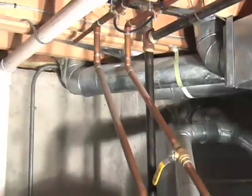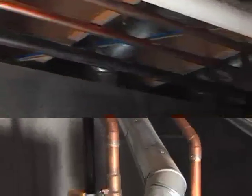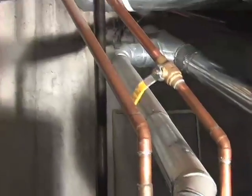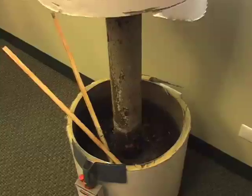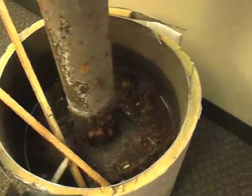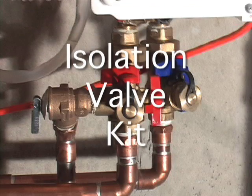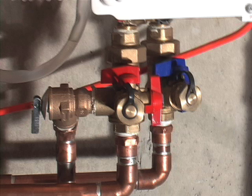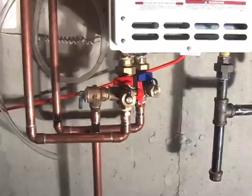The next step in the process is connecting your water. During the site survey, please make note of the water quality within the home. If the home utilizes hard water, a water softener is recommended. Without it, you can develop scale within the copper heat exchanger. This will diminish the life of the heat exchanger, just like scale does to a tank-type water heater. Although it is very easy to flush and clean the scale from a system with a set of isolation valves, it is still recommended a softener is used in hard water situations. Most municipalities will operate between 4 and 8 grains per gallon. If you exceed 8 grains per gallon, please contact your local water conditioning specialist.